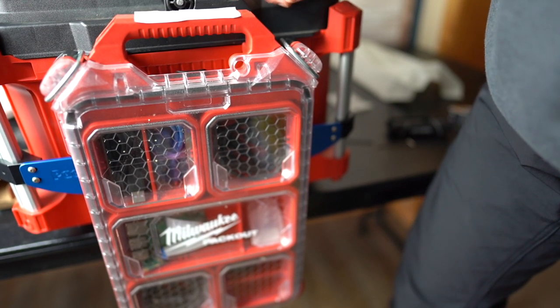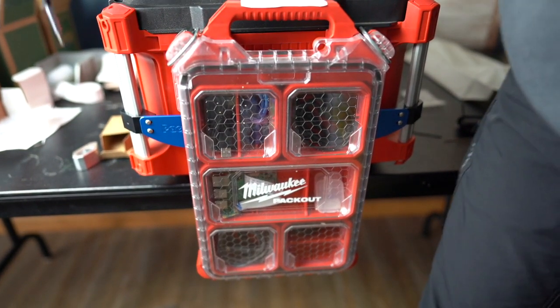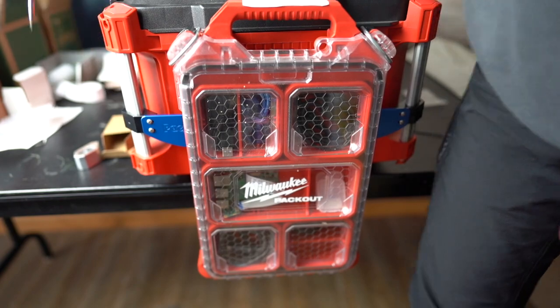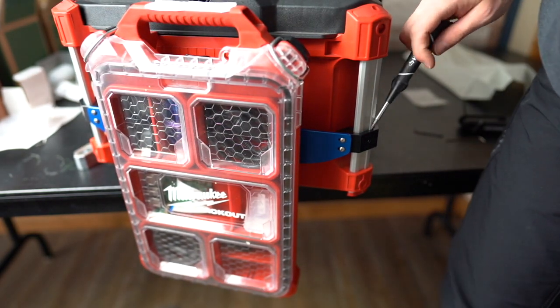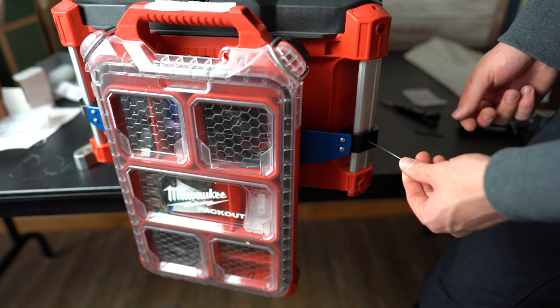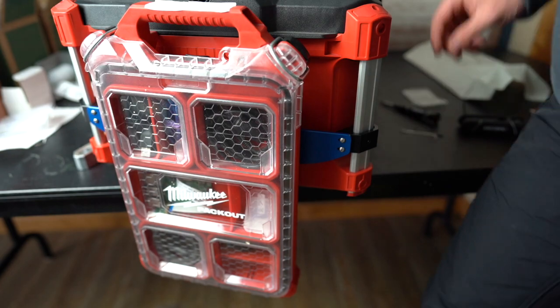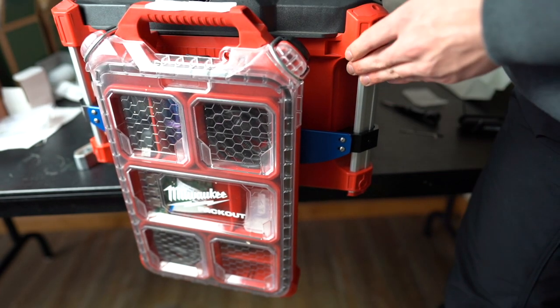The next thing you're going to want to do from there is to go ahead and tighten down the grub screws on this side and on this side. And when you're in there with your Allen wrench, just take them up till they're snug, and then maybe a quarter or half turn to tighten them. No more is needed. You will strip them out otherwise and have a problem.